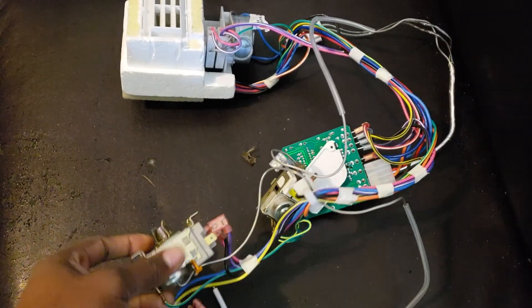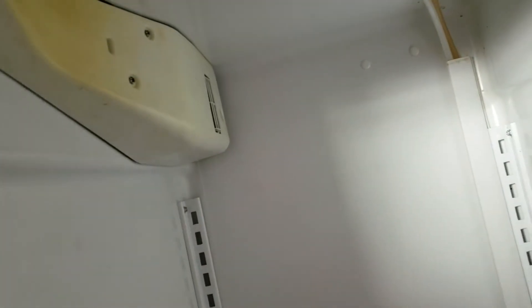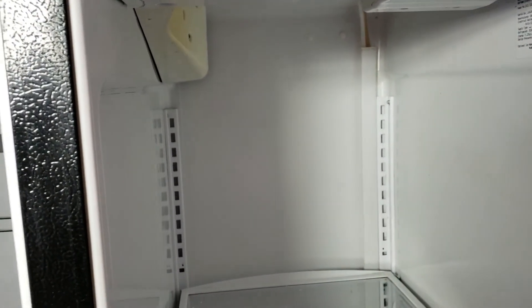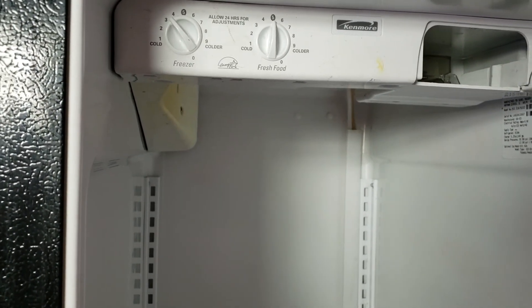I'll put a part number and a link at the bottom of my page. If your refrigerator section freezes up, it's most likely your thermostat — I'd say 80% of the time it's the thermostat, and the other 20% is probably that damper stuck in the open position. What gave it away here was the compressor in the back just kept running. It should run for about five or six hours and then turn off and go into defrost mode. It wasn't doing that, so I replaced this and now it's up and running. Any questions, feel free to comment below — thanks!